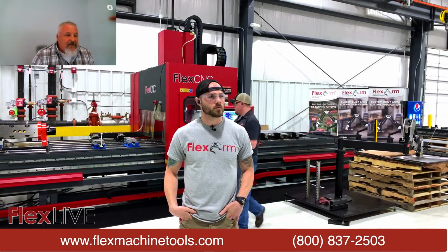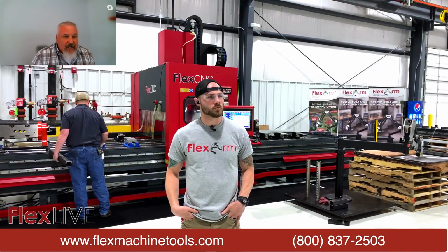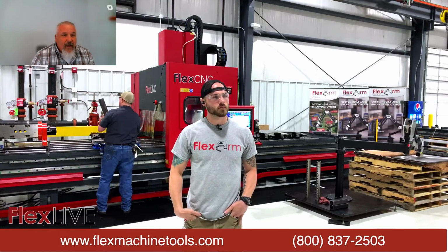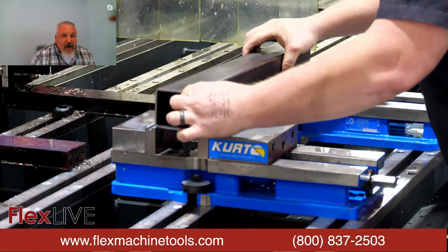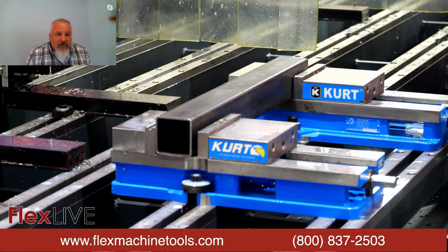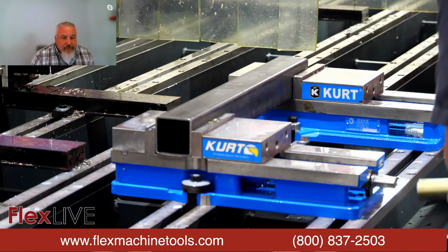And the standard tool can be used on any shape of material. We can use it on the round, we can use it on square tubing, flat stock, rectangular, doesn't matter. The flat style bit, of course, would be used on square, flat, round, any place where there's a flat area where we can go in and flow drill and actually make a spot face. I think that's what Aaron's setting up now, is the flat style, and you'll see the differences here shortly between the two. This bit's going to come down and actually spot face that top and leave it nice and flush.